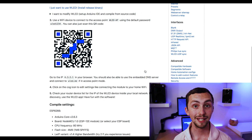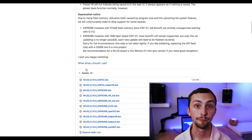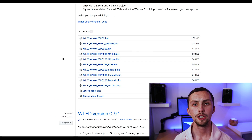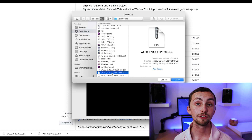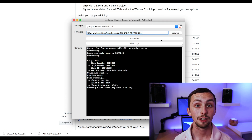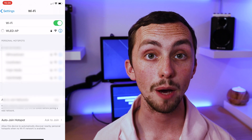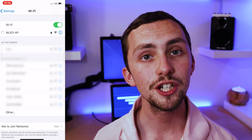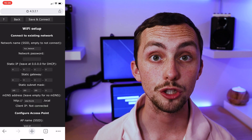Now we can move on to the software. Plug the D1 Mini into your computer using a micro USB cable, then head over to the WLED GitHub page, go to the wiki, find the binaries and download the latest binary for the ESP8266 microcontroller. If you're using a different chip you may need to use a different binary. Next open up the ESP Home Flasher app, find the right serial port, select the binary from your downloads and press flash. Once that's done, connect to the WLED AP Wi-Fi network — this should mostly bring up a pop-up window, but if it doesn't you can go to your web browser and go to 4.3.2.1.